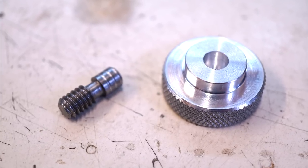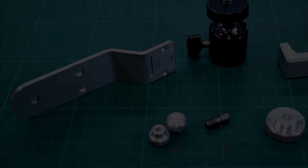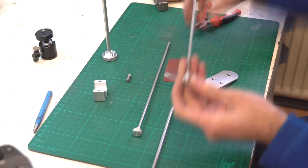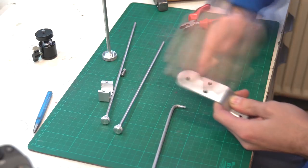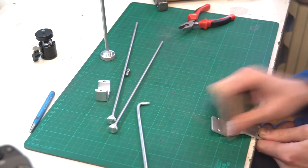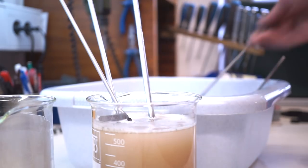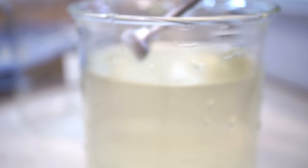And this is the result. I added 2 grooves on the screw so the glue holds stronger in place inside the knob. This is what I got so far. Basically this is everything I need, so prepare it for anodizing. All small parts mounted on aluminum rods where I connect the positive wire later. But this is the last chance to finish the parts before anodizing. Some kinds of aluminum become black after bathing in H2SO4, but it disappears in a second in another solution.